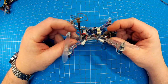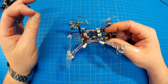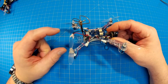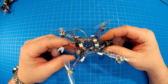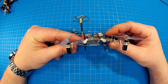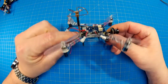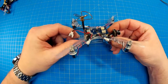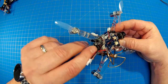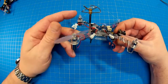I noticed I have more noise with this setup than I expected — it's still very flyable. The noise inside is very thin, just wavy lines across. But oddly enough, when you go outside those lines get bigger, so I don't think the range is going to be that great with this setup. The VTX in here is the FX-758-2 — the one with the blue bottom. It's fairly lightweight and soldering it was fairly straightforward; you can find a schematic online. There's something up with my dip switches though because I don't seem to be able to change channels as expected, but it does work.